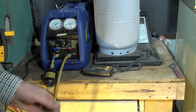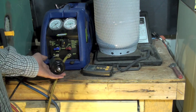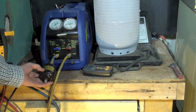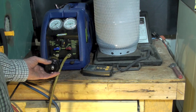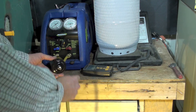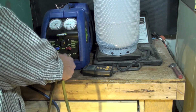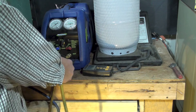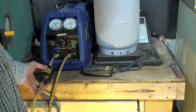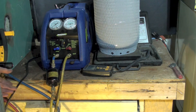This is now open, and one of the things about this: this dryer is no longer a dryer — it's a filter dryer — but it's no longer effective as a dryer if I leave it open for 24 hours. So I take the hose that I use for processing and I put it right there.